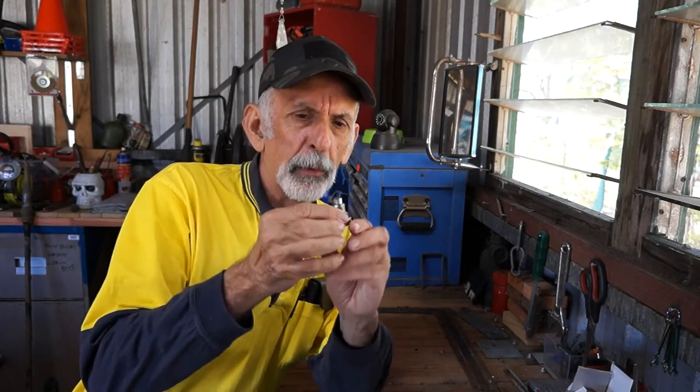But it was good. It saved this falling into the drink, which is a good thing. But I think you guys correct me if I'm wrong, I think the real aim of it being magnetized is, I've cleaned it now, but it was all these little iron filings in there, as I said, after the manufacturing process of the tractor. They say that stuff like that happens, so better for it to be stuck around the base of that than floating through the system. Alright, so that's why I was struggling in the middle of Niagara Falls.